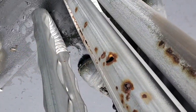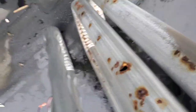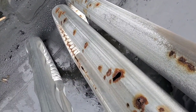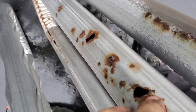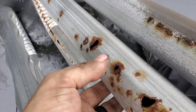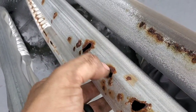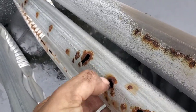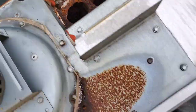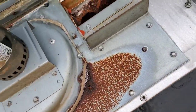Look at it. We found that crack while we were doing the initial inspection, but we didn't find these holes. Look at the size of these holes - see that? I'm pushing it through. I'm damaging the heat exchanger - armchair techs are going to have to change the pad now. We all know what causes that. I'm not going to get into that in this video.